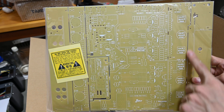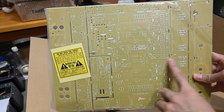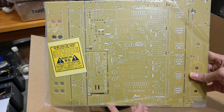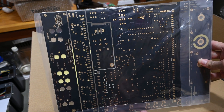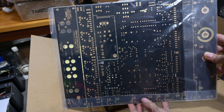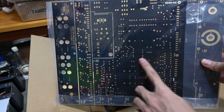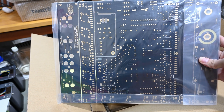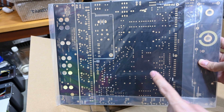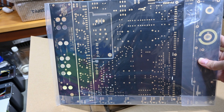You need to bend and break some of the PCB because it's just like playing Lego — you need to cut or break some sections and assemble them following the instructions. The backside is a black color PCB, gold plated. The PCB itself is not too thick, maybe about 1.7mm. Some of the traces are quite small, but I trust for the line stage it's probably not a problem. Maybe we can jumper some of the circuit with high-quality cables, which will give some improvement as well.